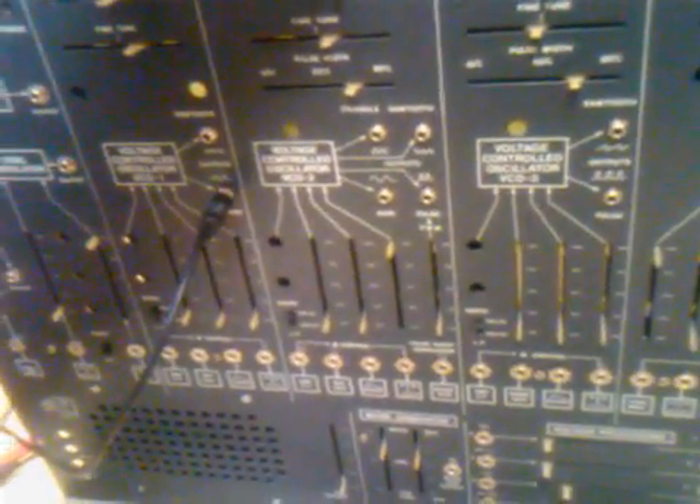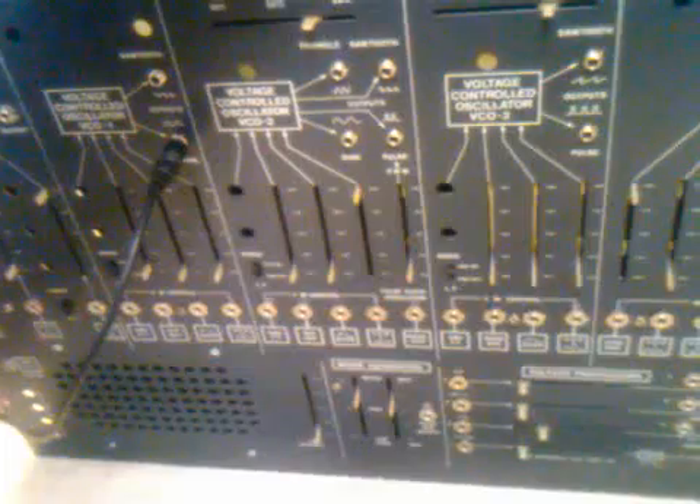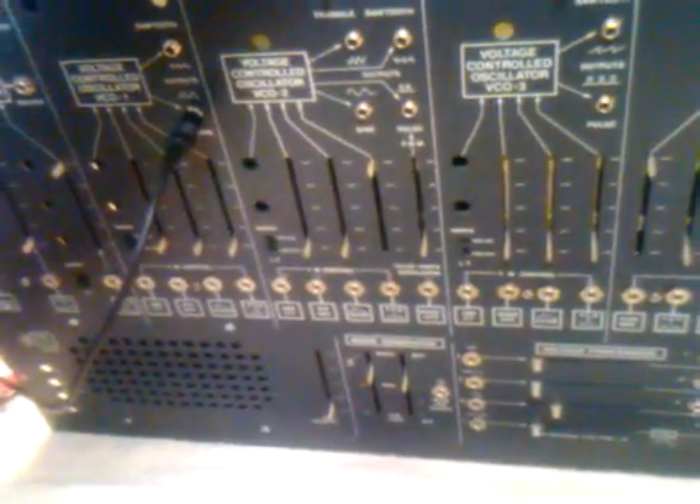What that was is the original 4027-1 oscillator has some tantalum capacitors inside of it that were shorting, and I was seeing the negative 15 volt rail shorting through to the plus. Fortunately the power supply protected itself and didn't hurt anything else.